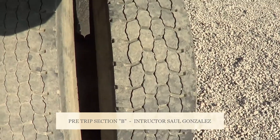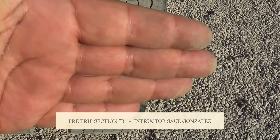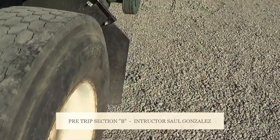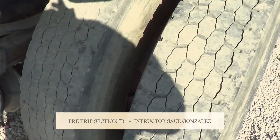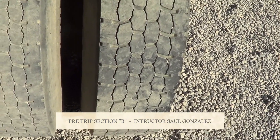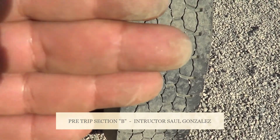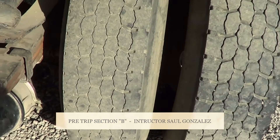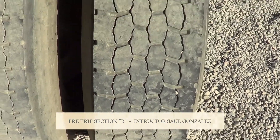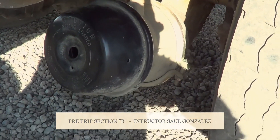You guys are going to turn it to this side. On the test truck we have right here, we're calling this the splash guard — this is in the back. It's a flat mat. But you have it on the front too — it's a splash guard. A splash guard is normally plastic. We're going to inspect it — it's not cracked or broken and it's securely mounted, no missing hardware. It's securely mounted to my frame, proper distance to my tire, and proper distance to the ground.